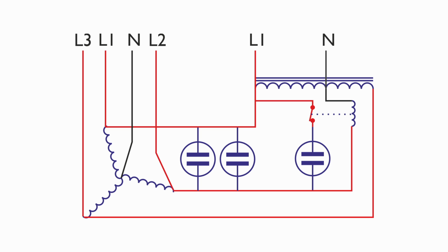And then the additional set of capacitors were for starting, and I've drawn these here just as a single capacitor, but again, as we saw in the previous videos, there was a whole block of those in the middle. And those ones are actually connected via a switch, or in this case it's actually a contactor, but those are only switched in when it's initially started. Now the original design had the contactor, which we saw in the middle of that original plan, and it also was powered via a relay. And inexplicably it was a wrong voltage, so someone had also put a resistor in series with a coil.